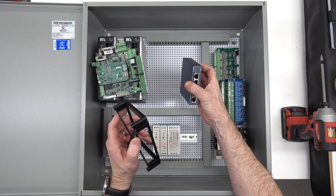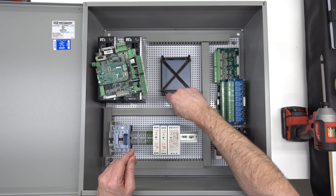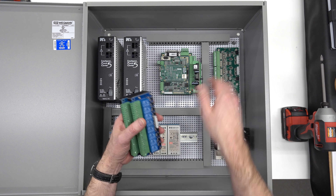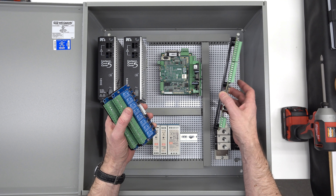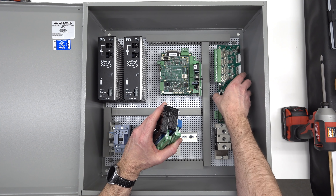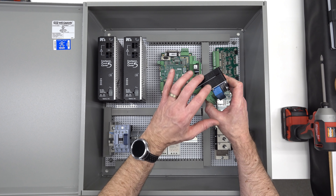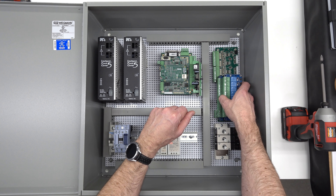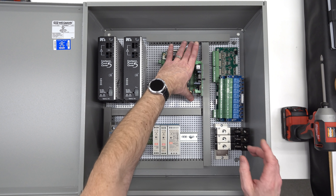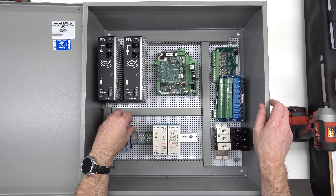I've got this switch, and instead of having to put it somewhere else, I can put it down here. I designed this 3D printed part that will just go over it, screw down to the back panel to hold that in place, and then it has threaded studs in the corners that I can just mount this PCB to. This is the Ether 1616 PCB, and I just made a similar mount for it that allows it to be mounted down to the backing plate. And then the relay boards — I've got some 3D printed parts that will allow this to be stacked on top of the expansion board, so that all the terminals can feed down into the wire ducts, and I should be able to fit everything in here and still have it be a nice neat installation.